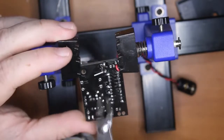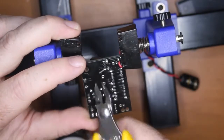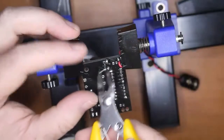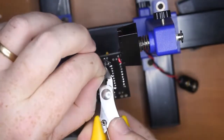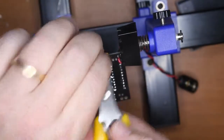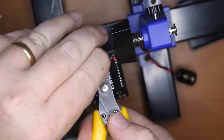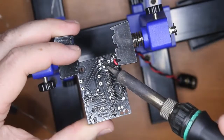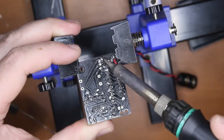And these ones, make sure, because they're a bit wider, that you cut them off this way, not that way, or you'll actually chew out your side cutters. These are flush cut angled side cutters, so you can get in nice and close to the action. There we go. Just going to tidy up this one a little. And this one.